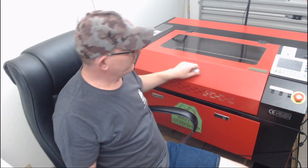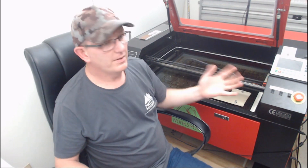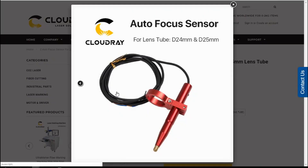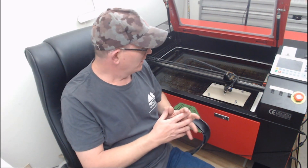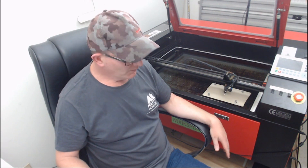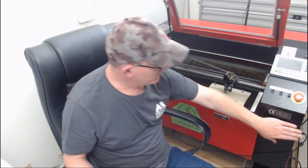I use different materials, different support methods — the honeycomb table, risers with magnets. I'd like autofocus because I'm changing between different material thicknesses and materials quite regularly, especially with the retail business I've started. An autofocus part from Cloudray Laser is also on its way, but I can't install it until I buy the Z driver components first, since the machine currently doesn't have a Z driver. Once those are in place, everything else will follow.